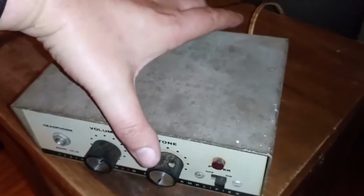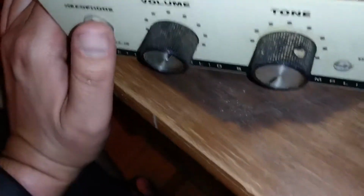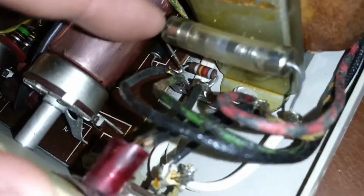Yeah, hear that? That means it's never been into. So this has never been touched. Let's see what we got. It's not as old as I thought it was. Okay. So it's got a chip in there. That's a relatively modern chip. Now I'm trying to find out why this isn't working. So okay, I'm guessing, okay, yeah, that fuse is just cooked. So, alright, that fuse is blown, that's why it isn't working.